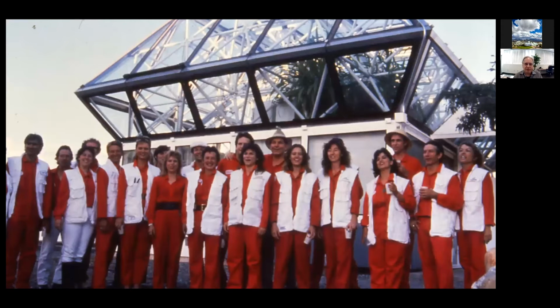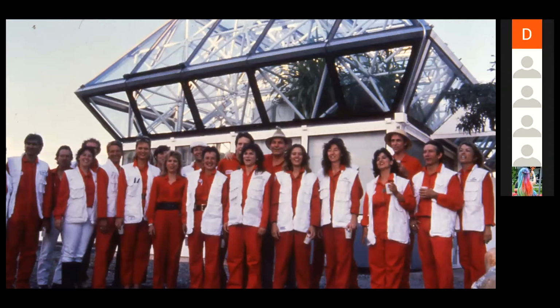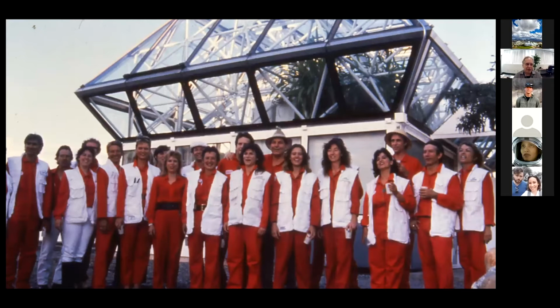This picture in the background, this is the first attempt at a glass and sealing system, and it really exemplifies an iterative approach to design. So we had the structure inside that you see, the space frame structure, and then over the top of that we had a welded frame system for the glass. And for many reasons, this turned out to be problematic, but one of the main reasons was we had 2 seals, an inner seal and an outer backup seal, and we thought, well, 2 seals are better than 1. But it turned out it was impossible to find the hole, because if you had 2 holes, they could be a long way apart, and you couldn't on the outside find out where the inside hole was, and vice versa. So actually the more complex system turned out to not be the right answer for us.